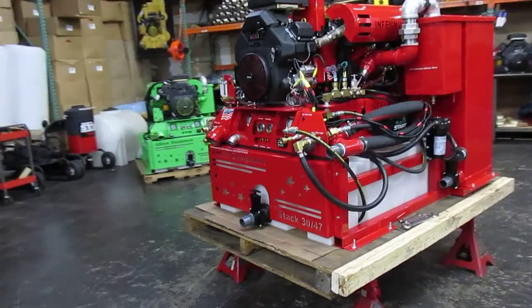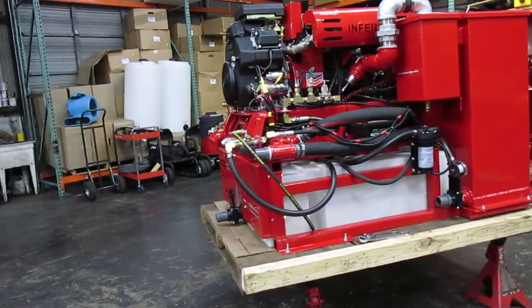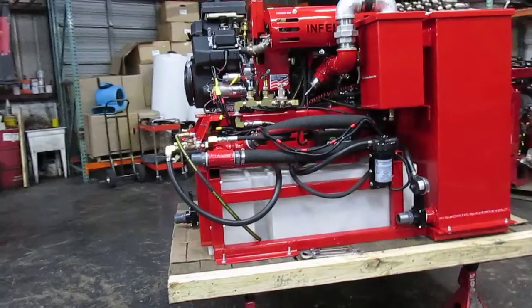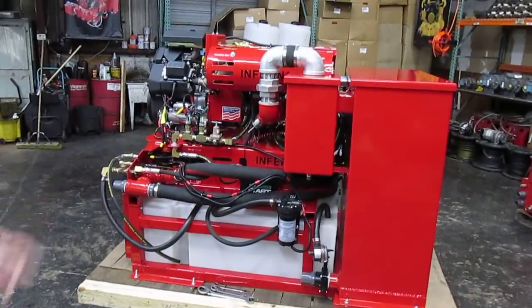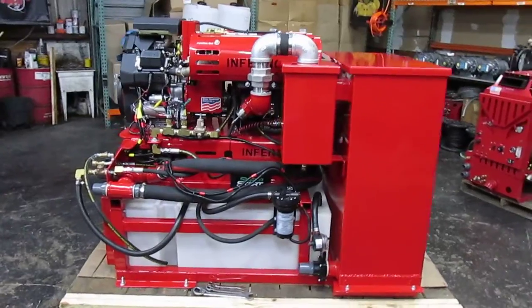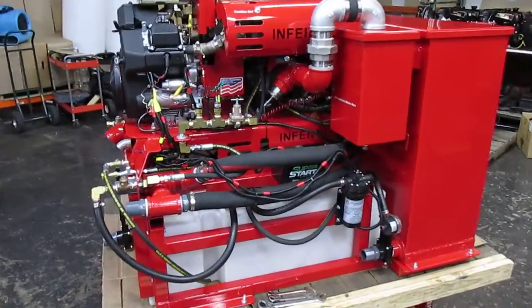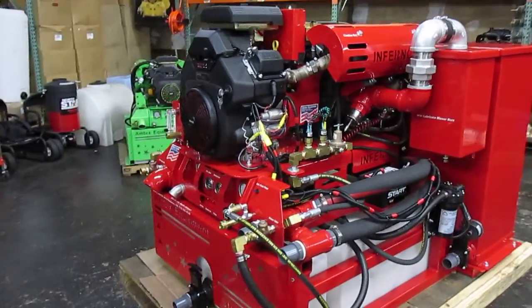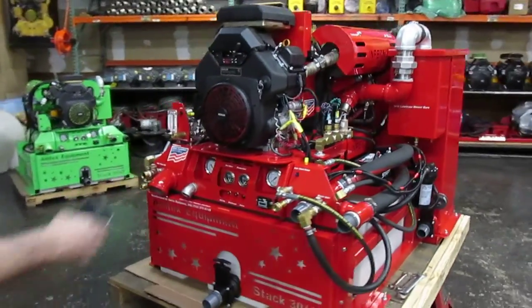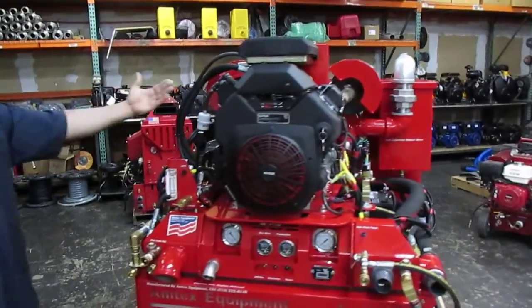This design used to be built in different horsepower, but one of the most popular configurations is the one you're looking at: a 30 horsepower power unit with a 4.7 blower, an 80-gallon recovery tank in the back with exterior filter housing, and on top you see a Hypro 2345 B-P — an almost 5-gallon positive displacement pump charging enough flow of water through these two massive heat exchangers.